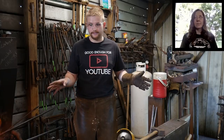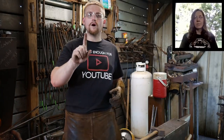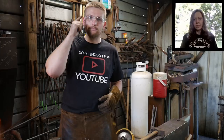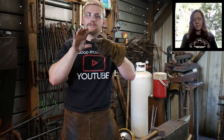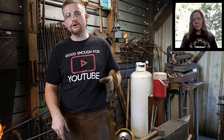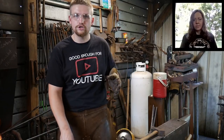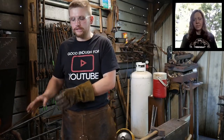It definitely doesn't. So what that has, it causes you to do one of two things. You either increase your hammer size, so you satisfy your brain and your visual hand-eye coordination to seeing that material moving out, or you start swinging for the fences harder and trying to push the heat longer than what you should. Bring this up to a high heat, almost a welding heat.